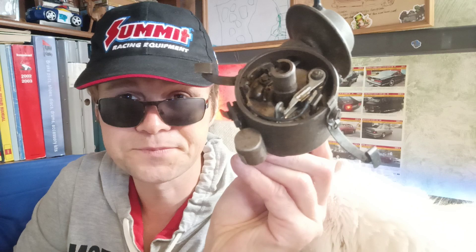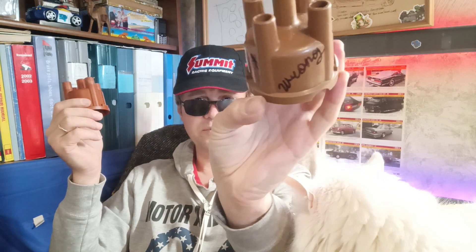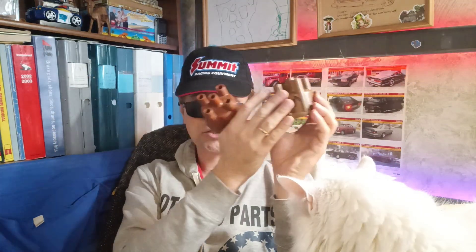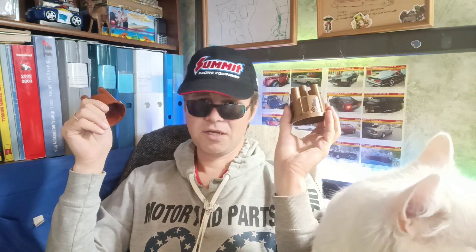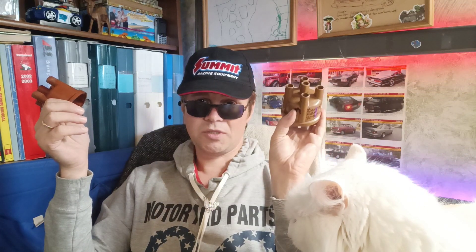You have no need to use something instead of this contact breaker - this is a really reliable system. But yes, like in all systems, there are a lot of pitfalls - hidden pitfalls. Here was a really bad part - I bought this aftermarket crap. Made in Italy. This is absolutely crap. This thing messed up my head for a lot of time before I figured out what was wrong. Never touch the ignition distributor cap while running - this is really dangerous. It hit my hand. And I decided to avoid these non-original caps. Only Bosch caps is what you want to use.